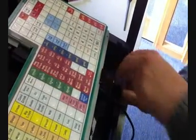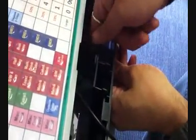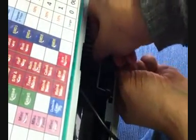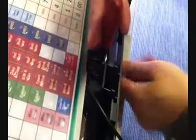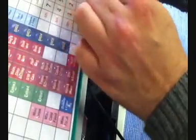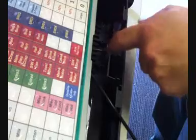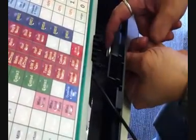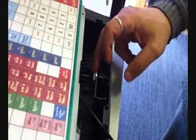After we've got those in, simply connect up. This needs to be really tight — if it's not, over time the button will just fall off. Give it a good tighten with a pair of pliers, making sure you don't over-tighten it and strip the plastic. You can use Loctite — it's probably recommended to put some Loctite on. I've used a few different things: plastic glue or Loctite will hold that well.